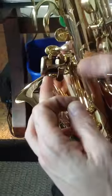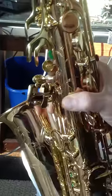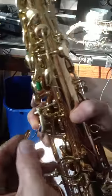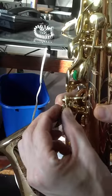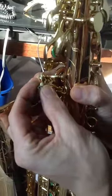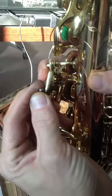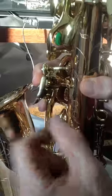We're thinking about what we're going to do with this pin, where it goes into this cage, and the shape of this cage. Remember that the goal of this project is not to create the crazy future horn — it is to take this horn that already has a good body tube, change a few things about the tube, and fix up the key mechanisms, which are the worst problem. One thing we thought about putting in this stem is a little ball bearing like this — you can see it would almost fit inside that cage. We could modify the cage, mount it inside, and you'd have a sealed bearing. Of course, we'd have metal on metal, and that can be noisy, so we're going to figure that out. We also have some nice Teflon balls we might put in there, and we may just change this cage and make it open on the outside.